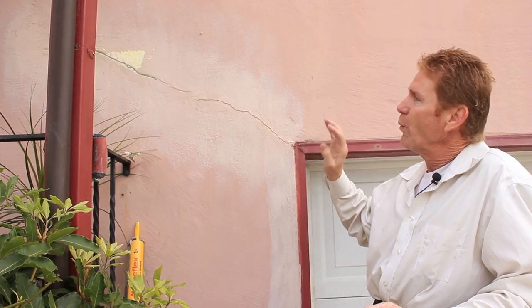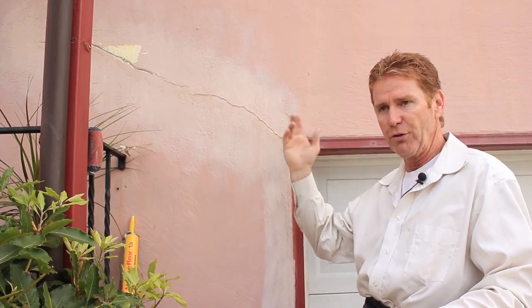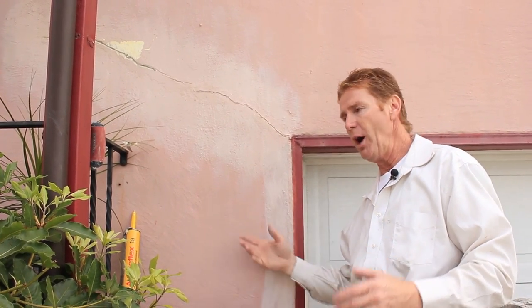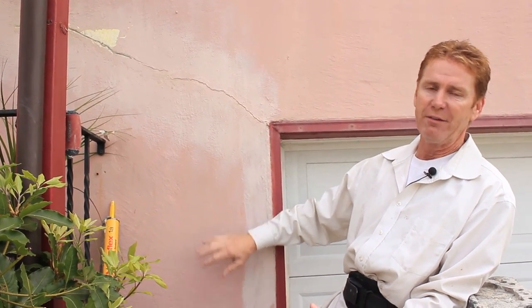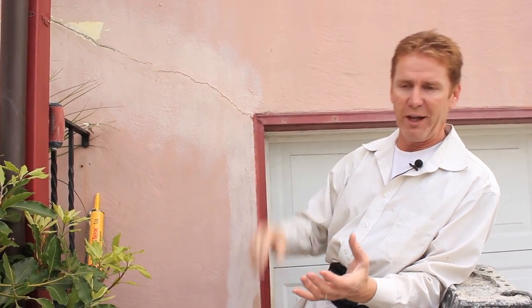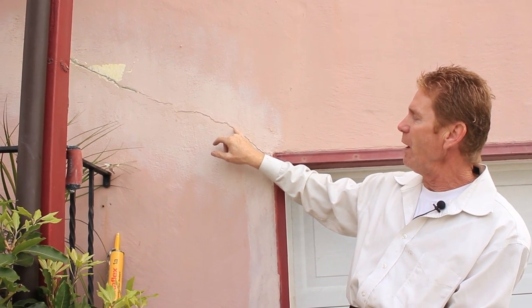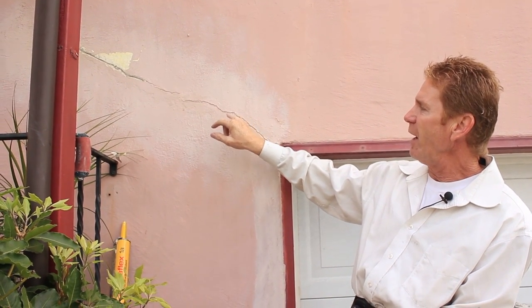In order to fix a crack you should have an idea what causes it. This is a two-story house in the Oakland Hills — one story in front, two in the back. What causes cracking like this is just natural, seasonal movement. When the rains come and then lift, the house moves and stucco does not flex — it'll hairline crack, starting like a hair on your head, then progressing to 1/32nd, 1/16th, 1/8th over five years. This one has been going about 10 years.